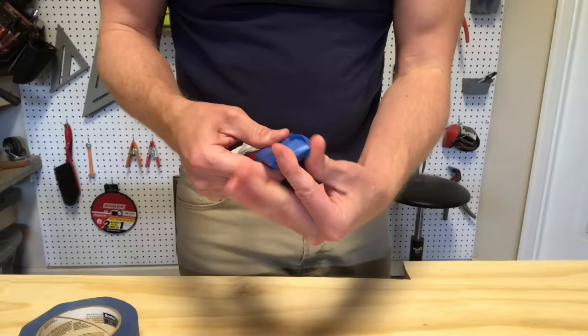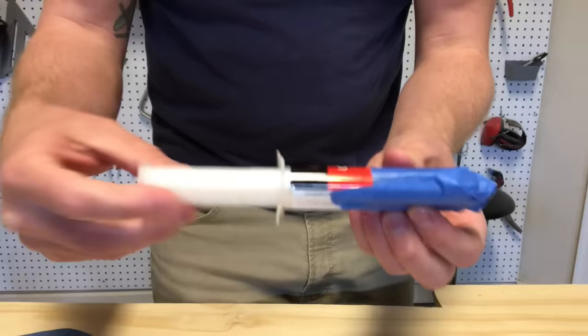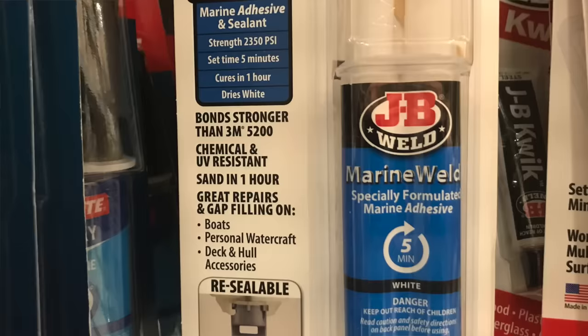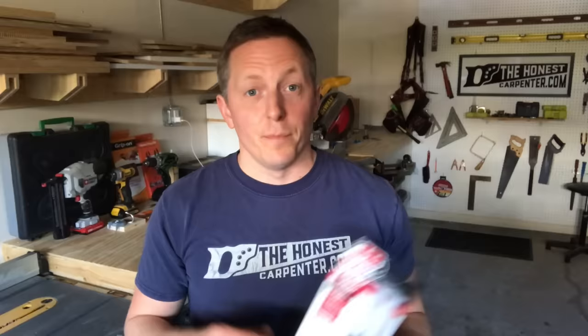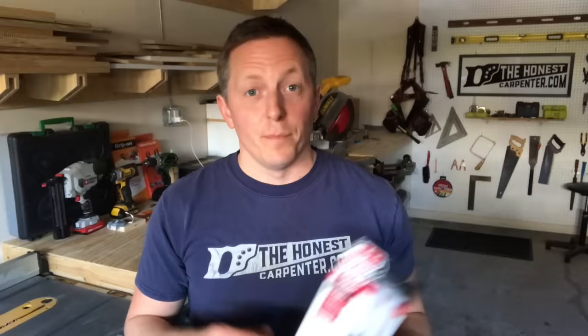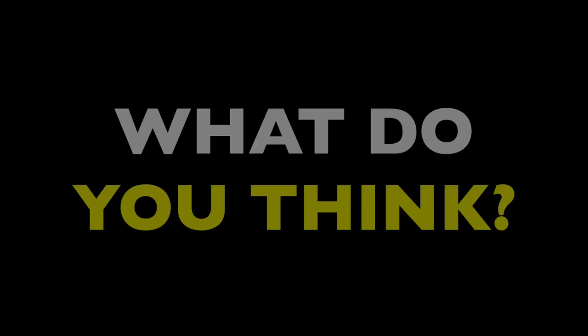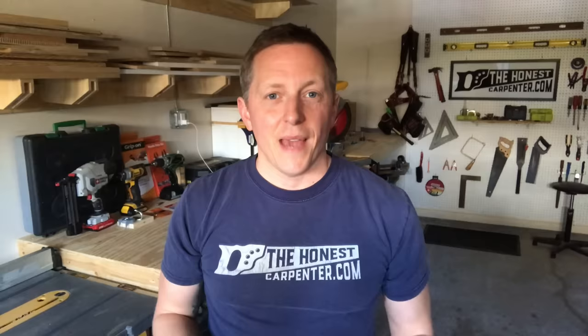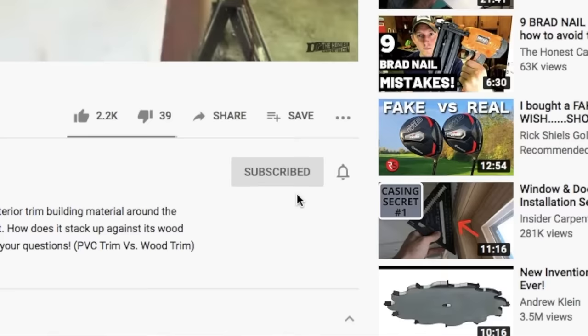By backing off the plunger, you can usually save much of what you have left. I like to tape the cap on and store it carefully, though you might want to wrap it in a paper towel just in case it leaks. Always follow the safety and application instructions of the product you're using, and get the product you need just by reading the packaging — there are a lot of types out there. But that's it: 5-minute epoxy, my superior alternative to superglue. Is epoxy adhesive new to you, or do you use it often? Let me hear about it down in the comments. I'll link a bunch of epoxies in the description — feel free to browse those. Thanks for watching, be sure to check back for more videos, and please consider subscribing and hitting the bell button for notifications. I'm Ethan James with TheHonestCarpenter.com — I'll see you next time.